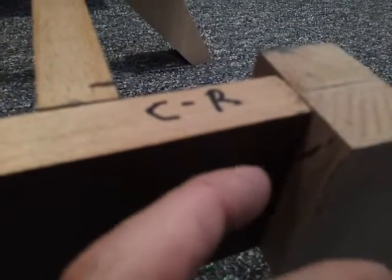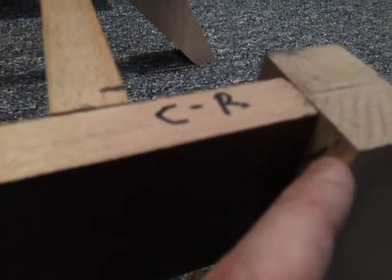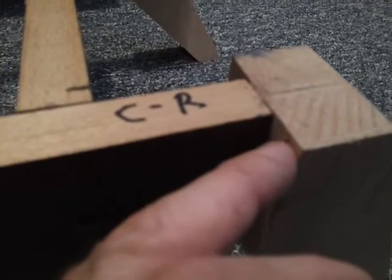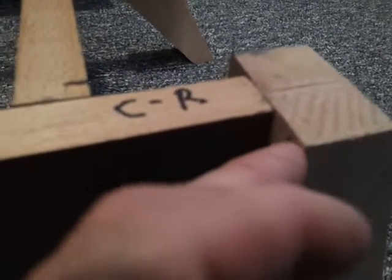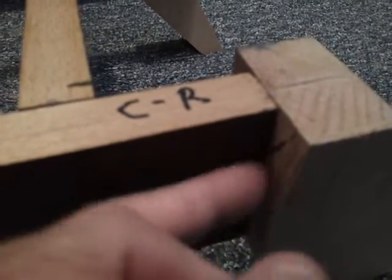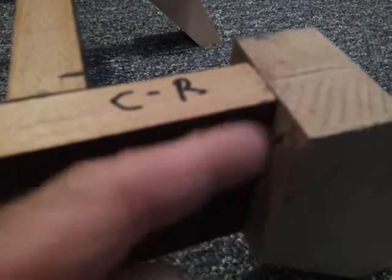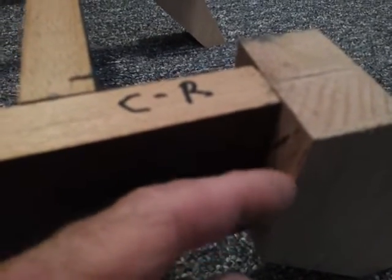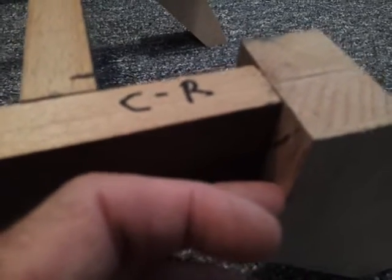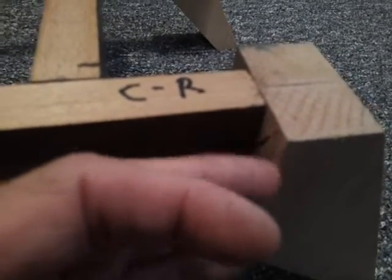And then I put glue around the edge of each hole in this piece of wood, the leg. I actually used a real thin knife blade that I had, but you could use anything, and just get it down all the way into the hole, onto the bottom, and make sure that the sides are covered real good, and push along the sides so that the glue will have good contact with it. The Elmer's glue, or wood glue, whatever, it's basically about the same thing, I guess.